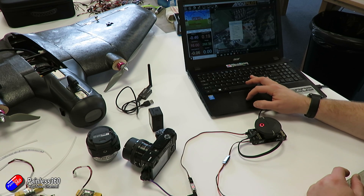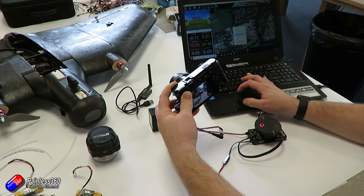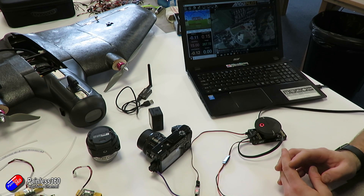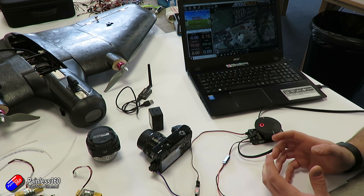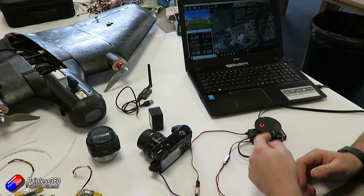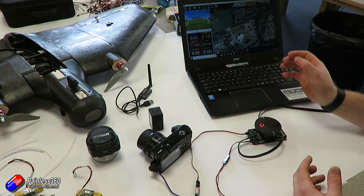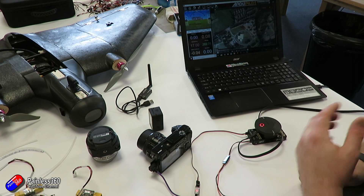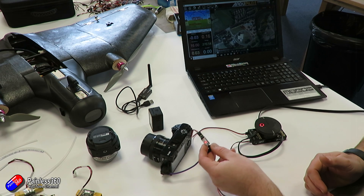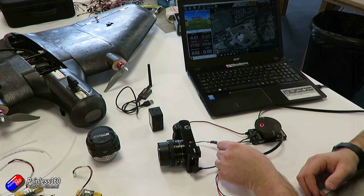From the main flight data screen in Mission Planner, right-click, trigger camera now. As you can see, it actuated the shutter. Right-click, trigger camera now. So now we know the camera trigger is working. If you wanted to operate the camera from a switch on a multi-rotor, you could map a toggle switch on, for example, your Taranis to pass through to main output 7. There's a little indicator on the Seagull ones — the red light pulses or fades in and out when it's in a happy state.